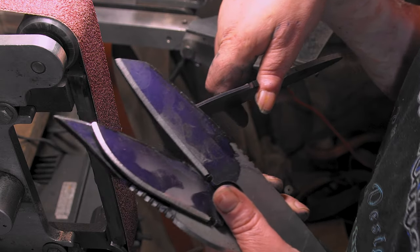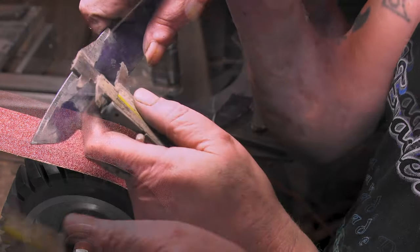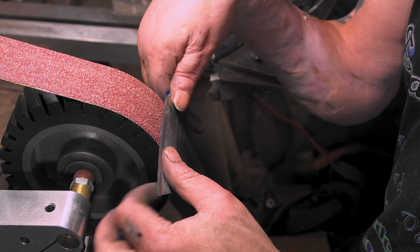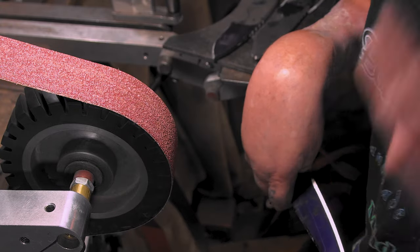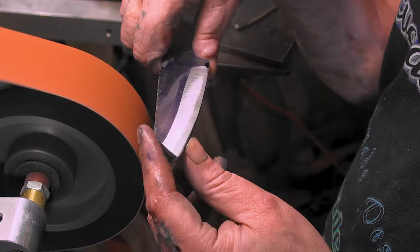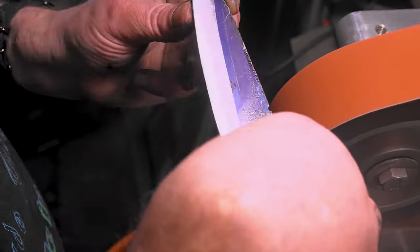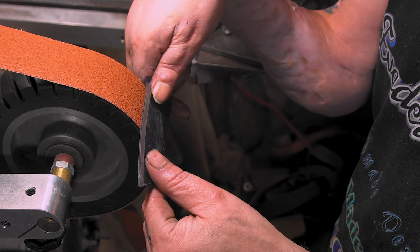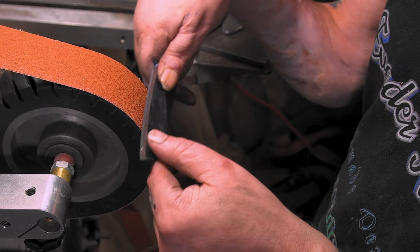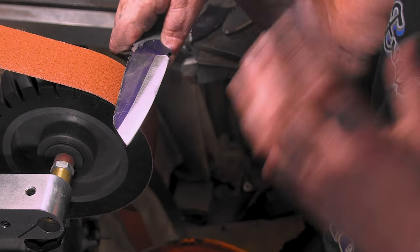Small wheel time, let's get it! These are just for marking. I only want to go like half the length. I am nervous, ha! I'm going to hang the belt over and start here and we'll just go into it slowly — I'll have to reteach myself hollow grinding. You just gotta start in the groove and then pull it across. Like every grind, your fingers dictate where it's going to be — your fingers and the pressure. Put your fingers on this line, bring the pressure to it, and just keep it slow.